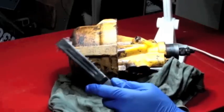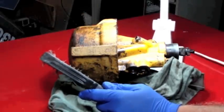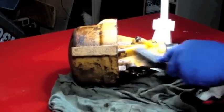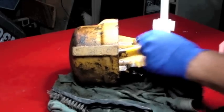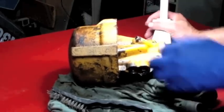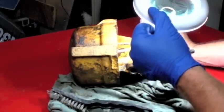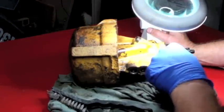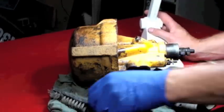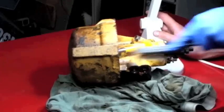I don't think that's going to tell me much — these could be casting numbers. 767 could even be a date: July of '67. You can tell it was hand-stamped because it's a bit crooked. On the casting there's also a little raised rectangle with a number that's more likely a usable number. There's quite a bit of paint on there, but where the paint's flaked off I can clearly see the number, so if I get the paint off I should be able to read it.